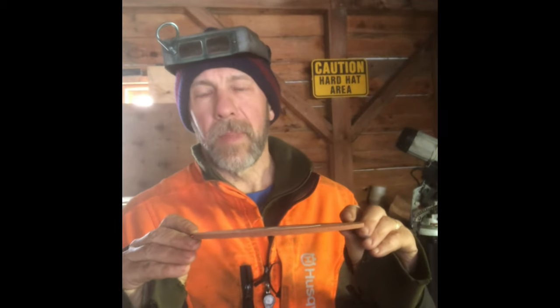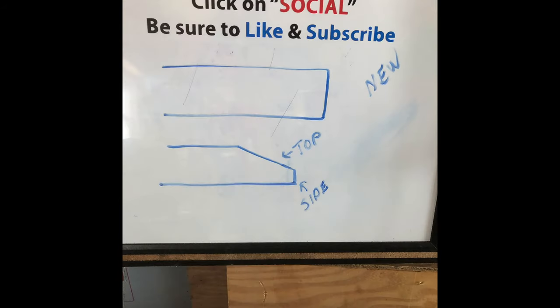When you buy them they're going to come with a square edge, so you need to put it on the grinder and dress it up. I'll post a picture of what I mean by the new stone and what we mean by dressed up — you need to shape it. Once it's shaped, that basically doesn't change; you just need to keep it clean. I'm going to throw in here a video on just using the dressers on the grinder.